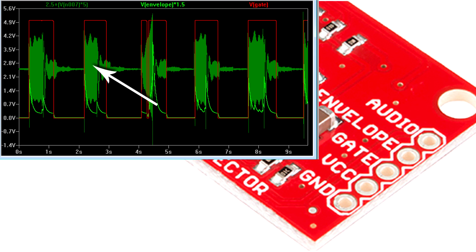The three outputs are: the amplified raw audio signal, an envelope that represents the sound level, and a gate output that indicates when the audio level reaches a certain threshold. We can't use the gate signal because we don't know what the threshold should be set at, as this may vary from flight to flight. The envelope is ideal because it nicely cleans up the raw audio and gives us the shape we're after.